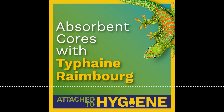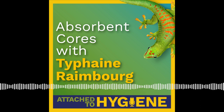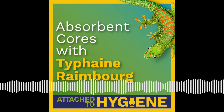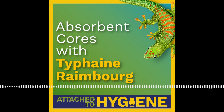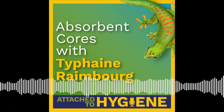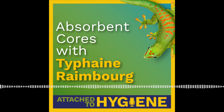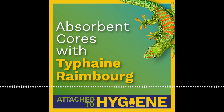You also have the channel core that emerged more in Western Europe. It's an optimized core for diapers with some empty zones in the machine direction. The upper and lower core wrap are laminated to create the channels in the middle of the core. This is typically done through modification of a drum-forming system and can be done with or without fluff pulp. There are also new substrates coming, growth in renewable and bio-based materials, and more niche products like hybrid diapers with removable cores or smart diapers that indicate when the diaper is spent.